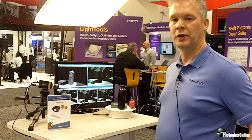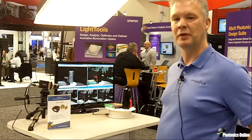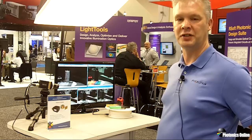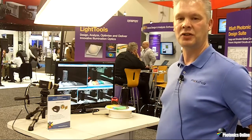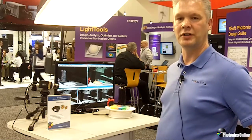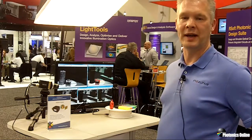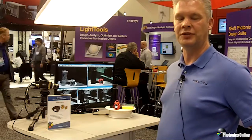Another product we are showing here is our multi-spectral imaging camera called Pixel Cam. The special feature of this camera is that it has a custom Bayer pattern integrated on the sensor, which results in a snapshot camera where very specific wavelength bands can be monitored in real time.